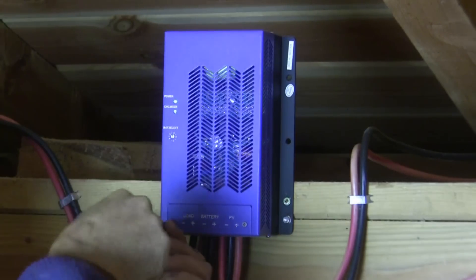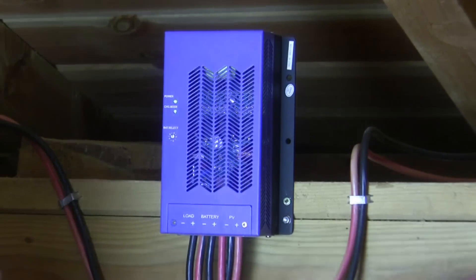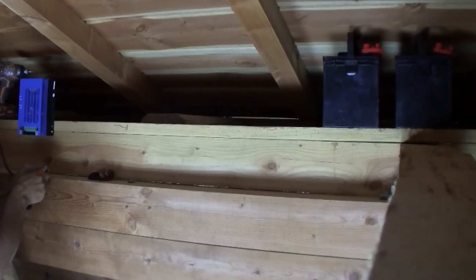The only trouble was it would only run on a 24 volt supply, which meant I would have to reconfigure the whole setup. The new machine included a charge controller and the ability to feed surplus power back into the grid where one exists — it was a great deal. However, I opted to use my already installed charge controller, which according to the manual accepts a wide range of incoming panel voltage and automatically detects 12 or 24 volt battery systems. The controller and batteries are up there out of the way and I wanted the inverter closer to my point of use — that was my original plan.